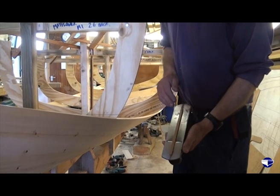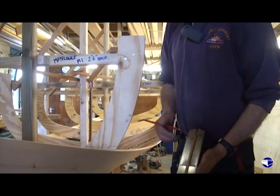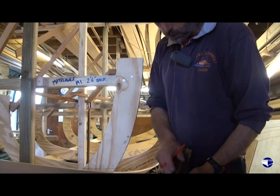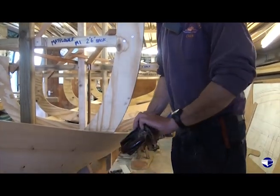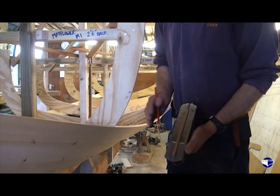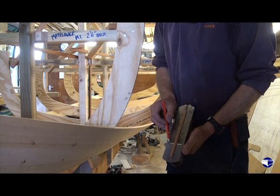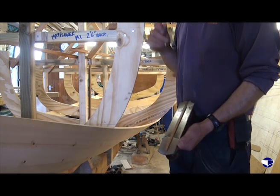This is a slightly modified plane — a strip of wood glued down the centre so I can use both sides of the blade depending which way I need to plane. The blade has just been chamfered off to give me the length of the overlap that we're using.